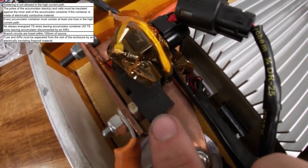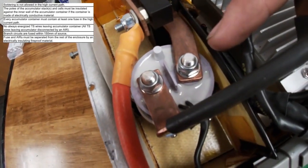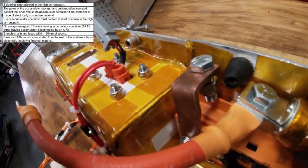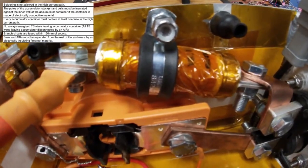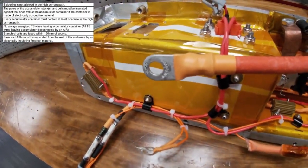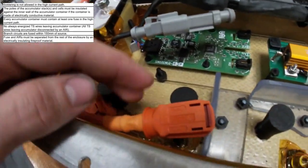This bolt here has a jam nut on the back such that the clamping stack-up is purely metal, and the plastic component which holds the head of the bolt is just used to maintain the location of the bolt, not to actually clamp in the high current path. The energy meter then comes from this bolt through this bus bar through the current sensor to the negative contactor, and then up through this bus bar to here. From here, it connects to the lid through this bolt, which has a nylon lock nut on the back. It then carries through the high voltage disconnect to the main output connector, which has nylon lock nuts on the back, and then through the fuse which carries the entire current of the output with a nylon lock nut on the back. It then comes down to the positive contactor, and then from here to the positive pole of the accumulator.